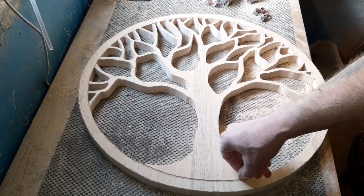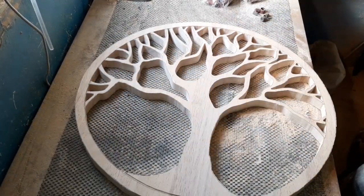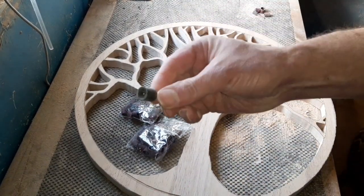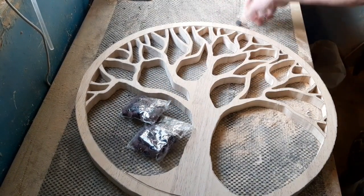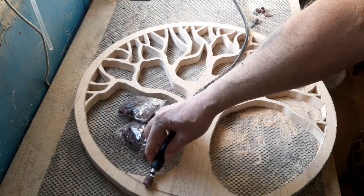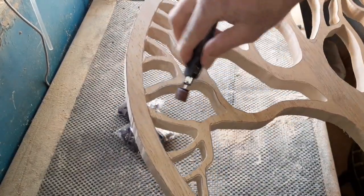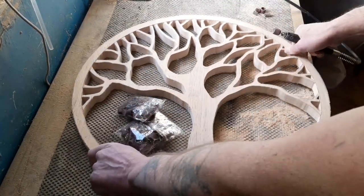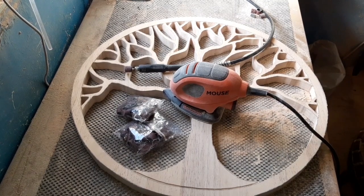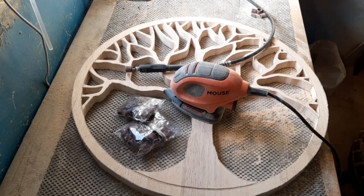And you notice there, we've done our little grooves all the way round. And that's just going to be enough for when we come with our Dremel and plenty of sanding drums. Bags, we're going to use a fair few of those. They come in different sizes, so you pop it on there, pop that into your Dremel. And the idea is, we'll get this started up, and later you're going to sand all the way down. And as we come into those little end branches, like I said before, we'll get a nice smooth finish, and we can just sand it. Get some sandpaper on, get the drum on, give it a nice bit of shape. We'll even throw in a bit of mouse sander just to finish it off, and the belt sander behind us, if the mood takes us. Right, let's start shaping this, and then we'll be heading towards the finishing line.